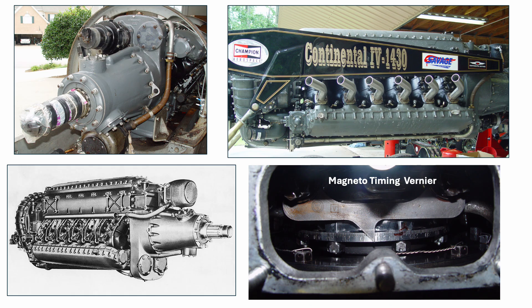Here are some detailed shots of the IV 1430 during the restoration process. The well-pickled and perhaps zero-time condition of the engine when acquired from the New England Air Museum in the early 2000s, and the unavailability of parts, gaskets, seals, and specialized tools, meant that while the accessories were refurbished, the power section of the engine was left mostly undisturbed. You'll notice the straight exhaust pipes. The IV 1430 used collector-type exhaust manifolds to feed exhaust gases to the turbocharger when installed in an aircraft, which produced a somewhat muted exhaust tone.